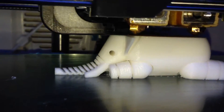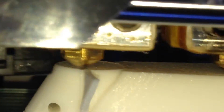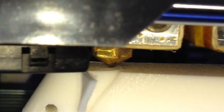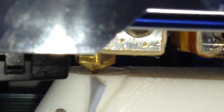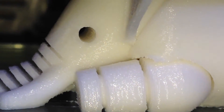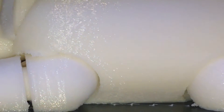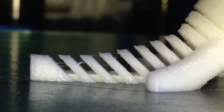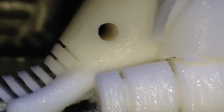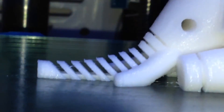And here we go. Wow, look at that. Now it's filled with infill — I probably shouldn't have done the infill quite so high, I wish I'd changed that. But look at the print quality at 80 microns. Absolutely amazing. Can't really tell the individual layers anymore. Look at the trunk — wow, that's some pretty fine detail. I'll put my finger in there for a size comparison so you can get an idea of how small this thing is.